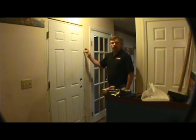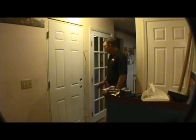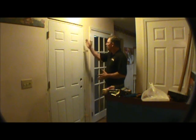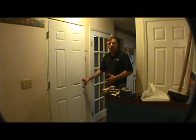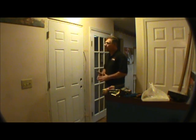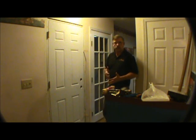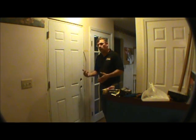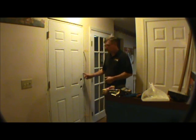Okay, so we've got our shingles in place. I love this. Only 2 shingles to shim a door out. When you get a door to fit this snug, you still want ample space between the jamb and your door so that it doesn't rub. You really have to watch seasonal fluctuations. We're in the winter months right now, December, getting ready to get into Christmas. Come spring, when the humidity starts cranking up, garages see the same temperature and humidity increases as the exteriors do. So we see a lot more swelling with woodwork in the garage area. So make sure you have plenty of ample space around that.